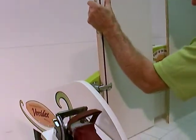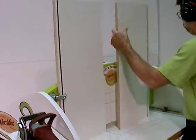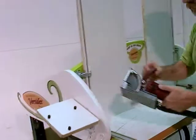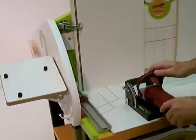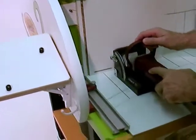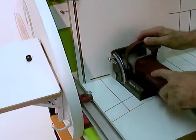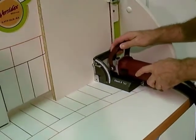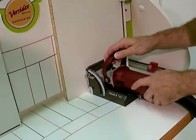When two panels will fit across the Mega's 31-inch platform, you can double mill. You can even mill in multiples, which we'll show in another video. Milling in multiples requires a particular template array dependent on your cabinet design, plus a few accessories to control all of the pieces. Both double milling and multiple milling can really boost your output, so you should try out those techniques.